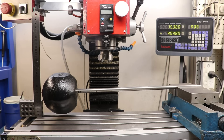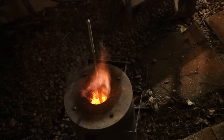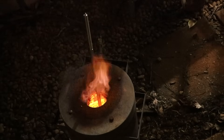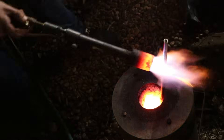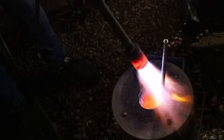What we need to do now is get it hardened and then test it again. Getting it hardened wasn't as straightforward as I thought it would be, because the piece of steel is a little bit too long for the furnace. I don't think I could have hardened the whole thing, so I focused mainly on hardening the middle and the rear, which is where most of the bending is occurring. The furnace needed to be red hot before I could take out the torch and then heat up the rest of the rod, and at that point the furnace was hopefully hot enough and insulated enough to keep the lower half warm.